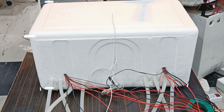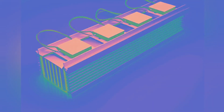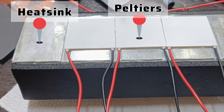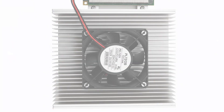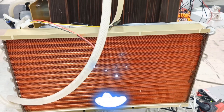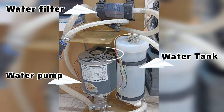For the freezer body I used a styrofoam icebox, and for the cooling module I used an aluminum heatsink and a peltier. I glued the cold surface of the peltier to the flat surface of the heatsink with silicone paste and placed the water cooling block on the hot surface of the peltiers. I placed a fan on the heatsink fins and cooled the hot water with a radiator and a fan. I also prepared a system for the water circulation.